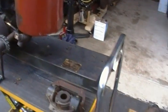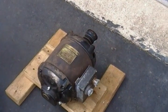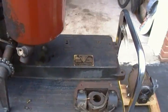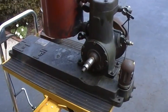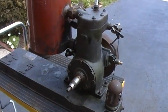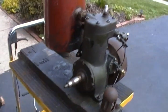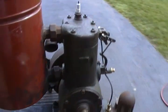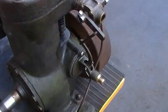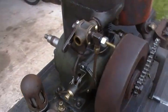My plan is to put the generator — the one from the other video — right where the old vacuum pump used to be. The generator has a max load of 300 watts, so if I load it up halfway or even almost all the way, two horsepower should be able to handle it. The model Y was only a half horsepower and that was at full load when I had 150 watts on the generator. This engine also has a flyball governor, so it's more reliable than the air vane governor that the model Y has.